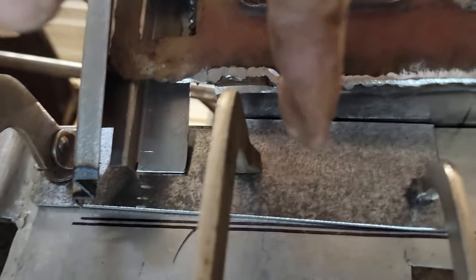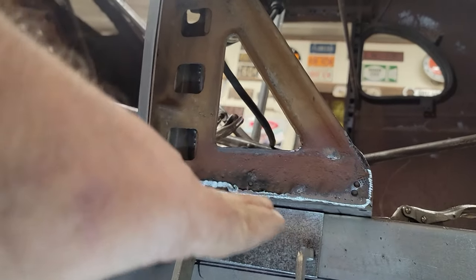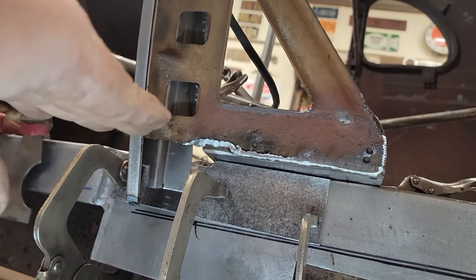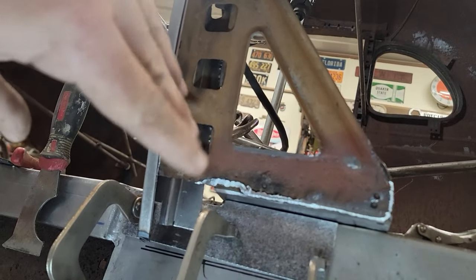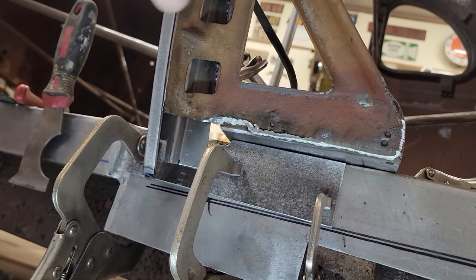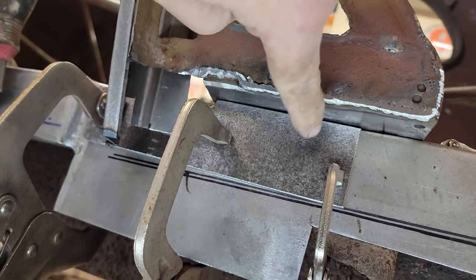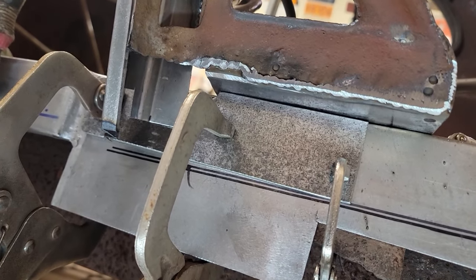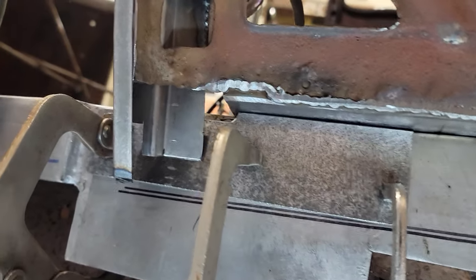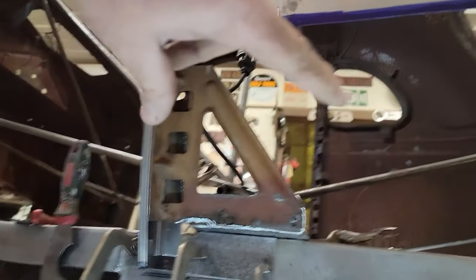And then I'm going to weld it up to the underneath side of this plate, which is supporting this bracket, so that'll give me my mechanical tie-in. It'll be bolted there on the face. It'll be tied into this triangular gusset, and that whole structure will then be, in my mind, integrated. I might put in a couple of gussets here in this edge. It's overkill and it's probably not needed, but I might do that just for giggles. I should be able to start thinking about buttoning this area up after I get that done, and I can commence to getting back on installing my panel here.